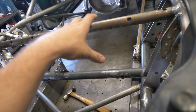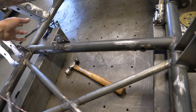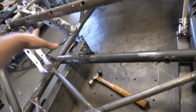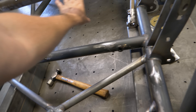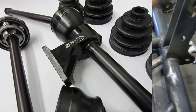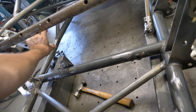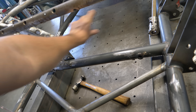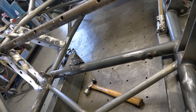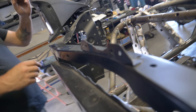One of the things I'm trying to solve — and this is my lack of knowledge completely — is we'll have the front diff here and we'll have an axle coming off that side with a CV. But then the other side, we're going to have a carrier bearing and then a cup for the CV, same shaft on that side. I was thinking maybe an axle going into, instead of the cup, a long axle with a flange. So basically the way that even the factory trucks are.